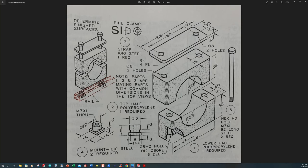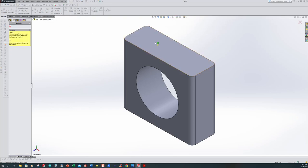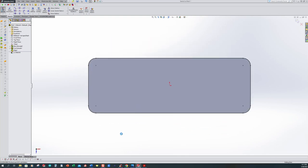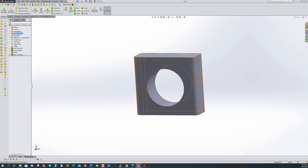Let's go ahead and put the strap on top. It looks like it's 4 millimeters thick. Let's create an Extruded Boss/Base on this very top surface. I select it and I don't want to draw that sketch again, so I'm going to use Convert Entities — it's going to ask me what I want to convert. I select this face and accept it with the green check. It's created a sketch for me and my sketch is fully defined. I exit my sketch. It kept 30 millimeters in cache — not what I want. I want 4 millimeters, and I also want to make sure I unselect Merge Results because I want two separate bodies.